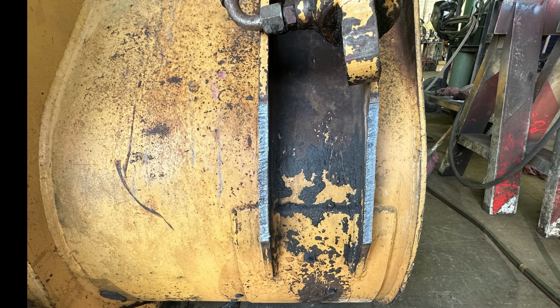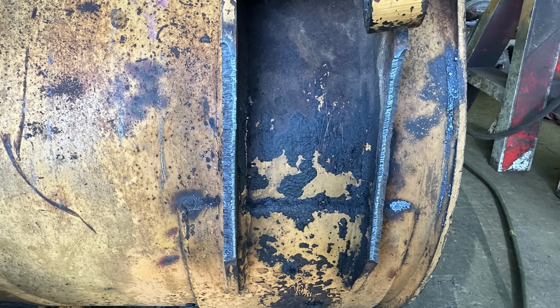As you can see, the lines are more or less the same height at the top and the bottom, and they're more or less parallel side to side. I didn't get a side shot, but this is the start of where we need to be attaching plates to these. So what I ended up doing after this is basically taking a torch and torch cutting bevels to save the time of grinding them. So here are the torch cut bevels. They look crappier in this picture than they really were. It literally only took about 5 minutes with a hard rock to smooth these out perfect. So that worked better than I would have expected considering how poor the material was.